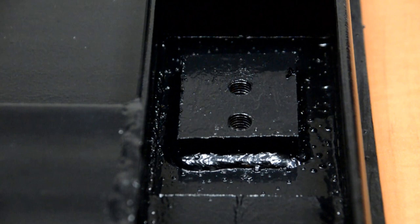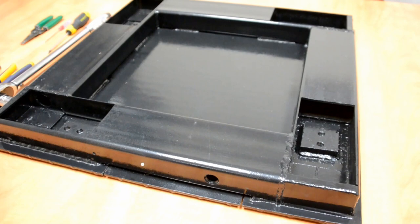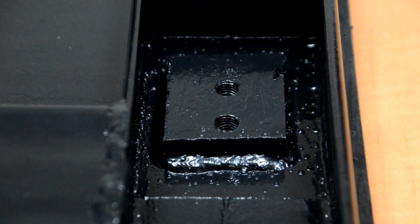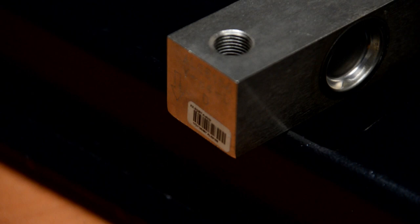You have four pieces of half-inch threaded plate in your floor scale kit, and these plates need to be welded onto a deck plate. In this case we have a two-by-two base with tubing. You can be innovative to build your own base, but these plates need to be welded. For a small capacity, you can mount the plate, drill a hole on the other side, and use a screw and a nut to fix it, but it can only hold one thousand pounds or less.